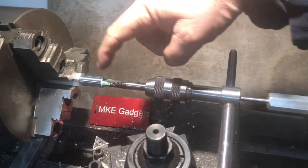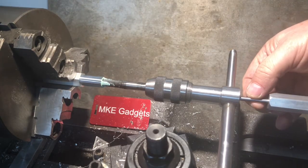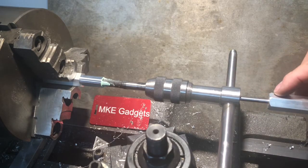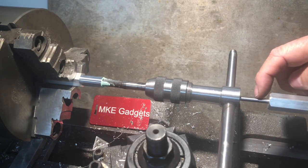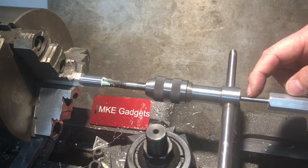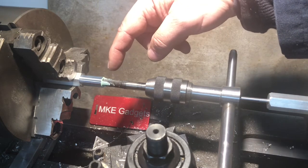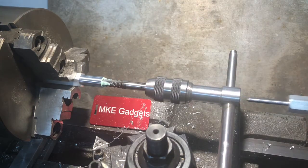You can see as the tap goes into the part I'm tapping, the spring pushes the probe and the tap follower out. What I'd like to improve on this is some kind of indication marks so I know how far I've tapped. If I put some grooves in here a quarter inch apart then I could easily tell how far my tap has traveled. I'm tapped as far as I want to go, so I just slide the tailstock back.